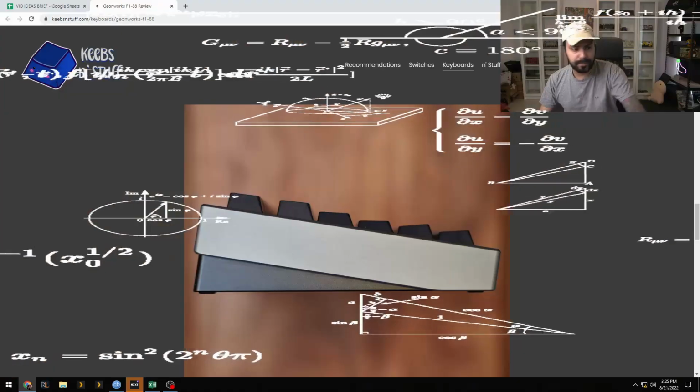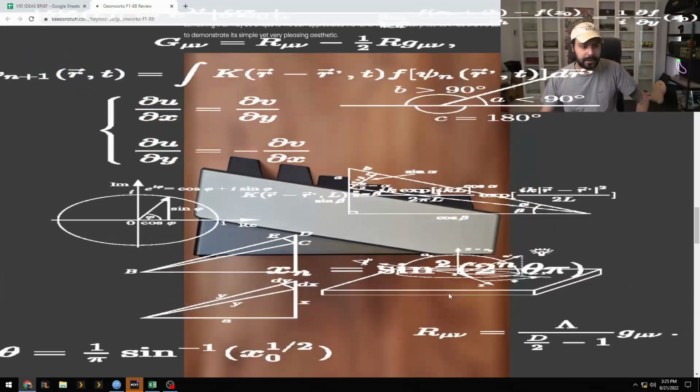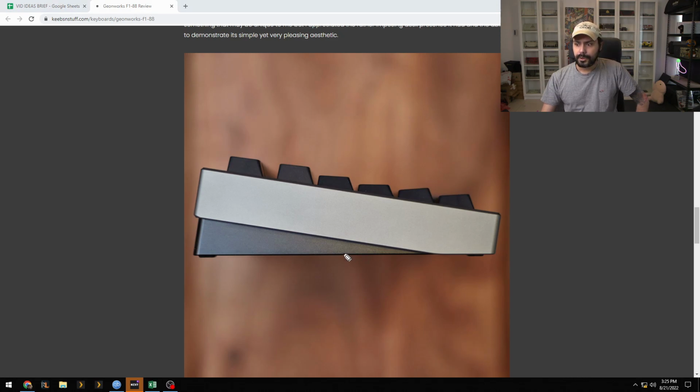Now, the next thing you're trying to look for with anodization is something called banding or streaking. This is generally okay. I wouldn't send it back for having streaking or banding, but I'll show you an example of that. Now, I don't have a board with streaking, but here's a good example. It's an okay example. Here we can see banding on the black area, where you see darker bits, lighter bits, and basically streaks, right? Generally, for banding, if this is supposed to be a solid color, this part right here, use your imagination, but if you see that the center of it is a darker or lighter color than the top and bottom, that is banding. That is generally acceptable by most makers, but it's something to keep an eye out for.